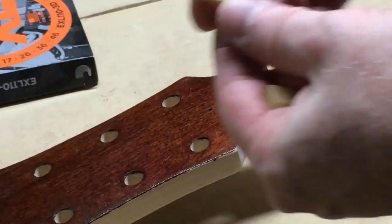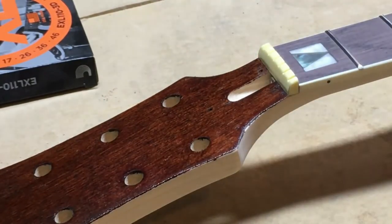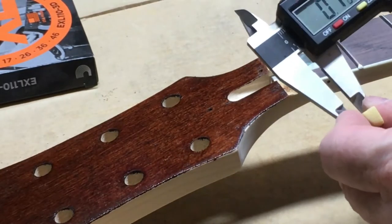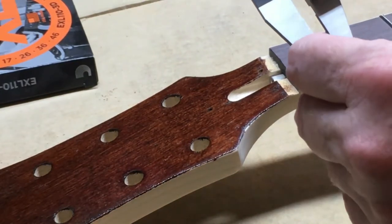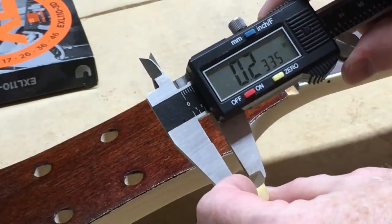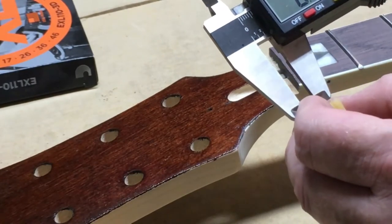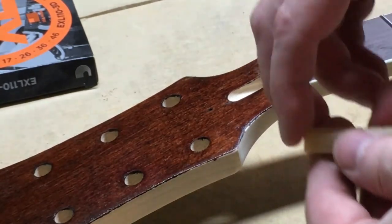But as I mentioned, this is the nut that came with the kit, and it was right at 6 millimeters. I could tell you what that is here in thousandths of an inch. Actually, I could let you see that. Can you see? So around 2.35, and then on the one that I just made, we're at, you see that, 2.5. So I need to thin it this way,